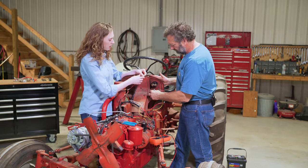We're not running the tractor long since we don't have the radiator on — you don't need to take your radiator off to do a 12-volt conversion, we just took ours off so you can see what we're doing. We just wanted to run it for a little bit to make sure the gauge is showing a positive charge, which is what you want to see to indicate your charging system is working as it should.